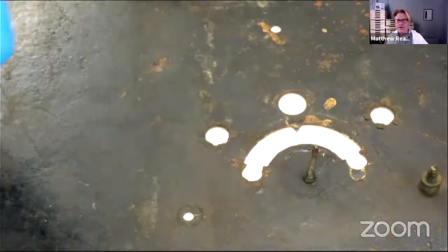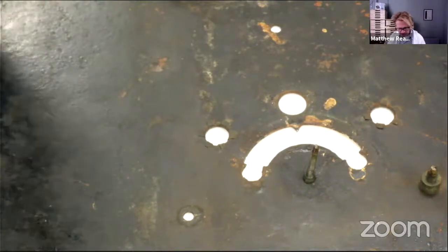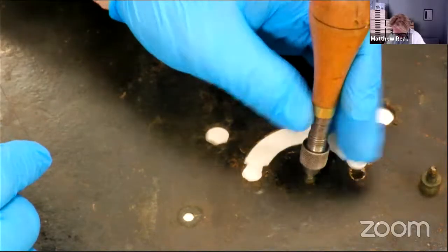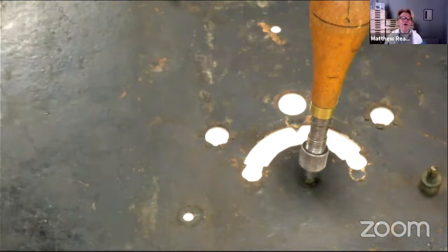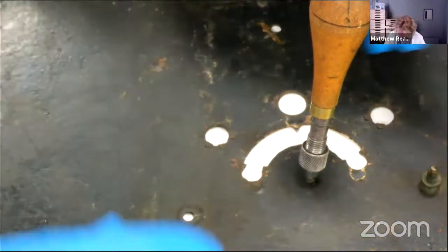So ideally, here what we'll do is maybe drill a bit of brass and broach that out and use it to lever this thing back square. Let's say I'm a bit worried about the painted surface. And of course the thing might break out with the dial as well. It's all pretty sort of fraught with difficulty, or it might snap off.